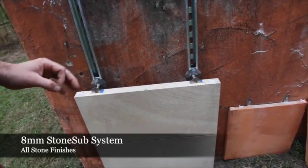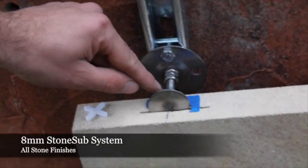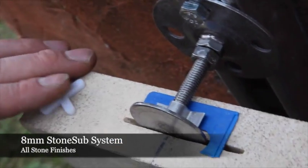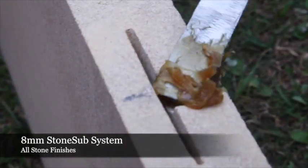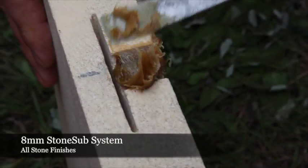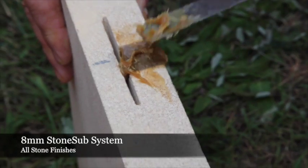With the installation here, you can see that we've used our 1.5mm spacer underneath our shaft, which we've then protected with a shaft cover. We've allowed a 5mm spacer here to help with our joint. With the installation of the panels, we're now going to put a reconstruction glue into the cavity which we've cut out to go over the shaft. We're now about to place the panel back onto that millimetre adjustable clip.